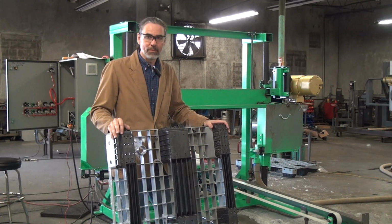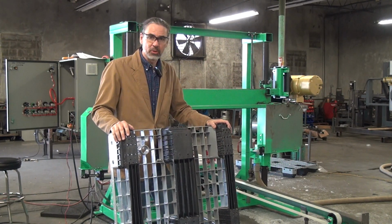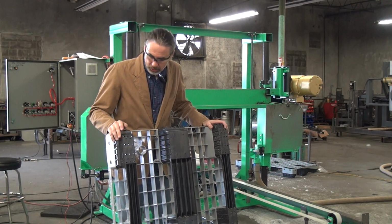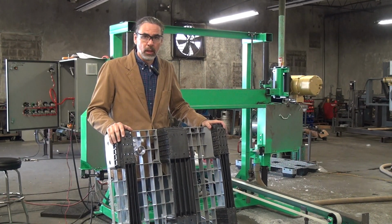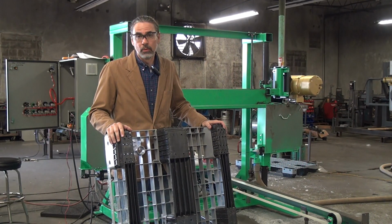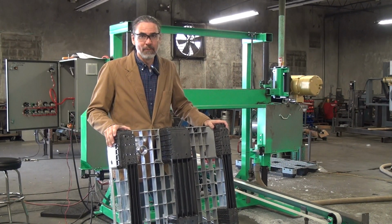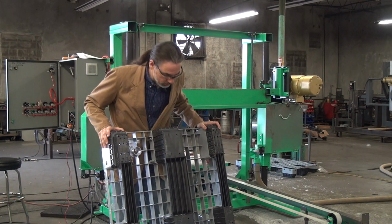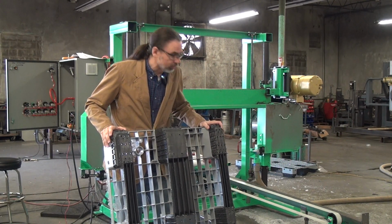The blade drive motor was not the limiting factor. I'm pretty sure we can run the table faster. Might run the blade a little faster, so could certainly get more speed out of the table feed. If I had more pieces to play with, I would keep iterating up. I suspect the customer winds up with something close to 50 to 100% faster cut speed on these products, but I'm gonna call it a success.